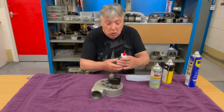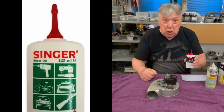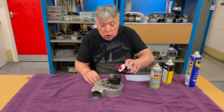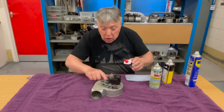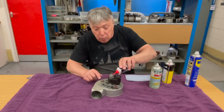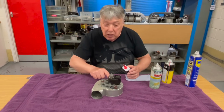So imagine this was Singer sewing machine oil. Here's a picture that we've got. I couldn't get one in time to make the film. And all you're going to do is put a couple of drops in here and just gently move it. A few more drops, gently, to get it into those bearings, and you'll find it's going to be a lot easier.